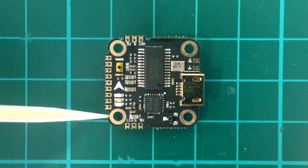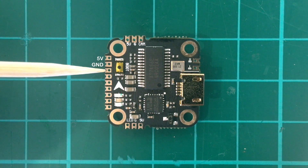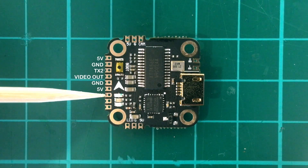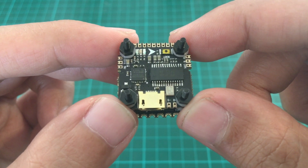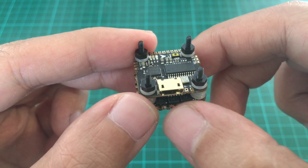We have pads for the VTX and the RX. For the VTX: five volts, ground, TX2 for smart audio, and video out. For the RX: ground, five volts, 3.3 volts for DSM receivers, PPM, and SBUS. The SBUS pad is actually a general purpose receiver input pad — it automatically detects the protocol and activates or deactivates the inverter, so you should be able to use FlySky, DSMX, and other non-inverted protocols. To orient the FC with the USB port at the back, you can snake the motor wires through, wrap around, and solder to the pads.